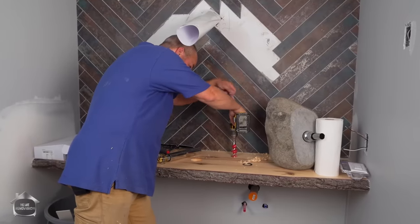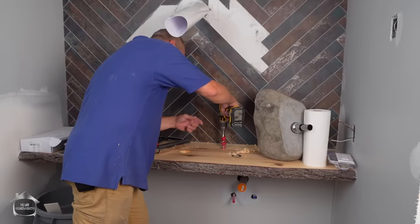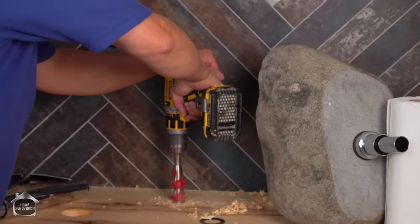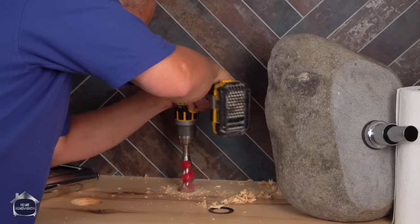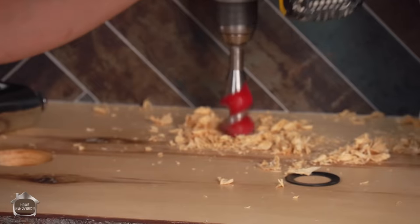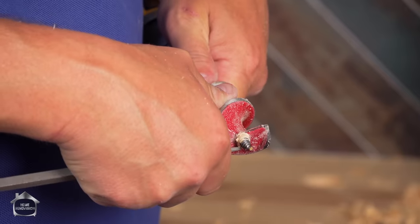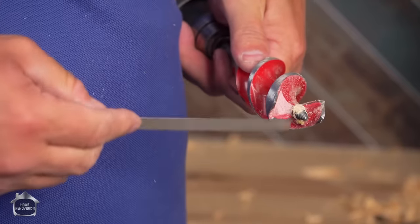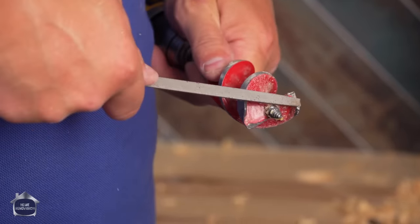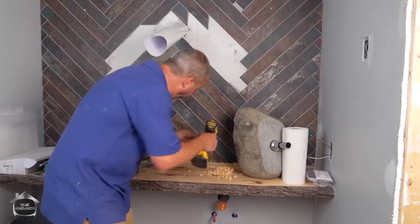If you wanted to go straight, put the pressure in the middle of the drill behind you, up from here. If you're pushing with your hand, you're always going to be twisting. So hold it with this one, but push from the top. Full of sawdust here. As a result, the threads aren't pulling anymore. So, just clean that one more time. Now that should be enough to finish this off.